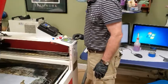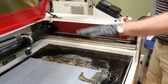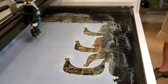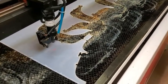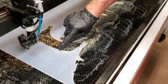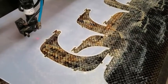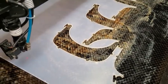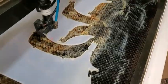This is where it gets a little trickier. You're going to leave the cover open, then press start. What that does is have the laser go through the motion to make the shape, but without the laser actually firing. What you're looking for in this area is to see if it's lined up properly. Make slight adjustments. The first one just barely made it, and we're looking for one more point on the second visor.